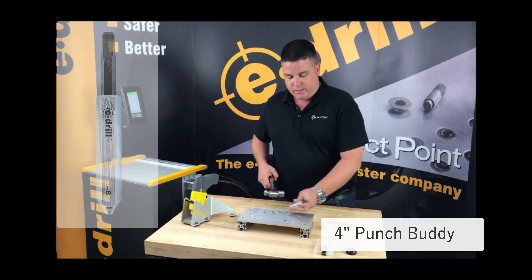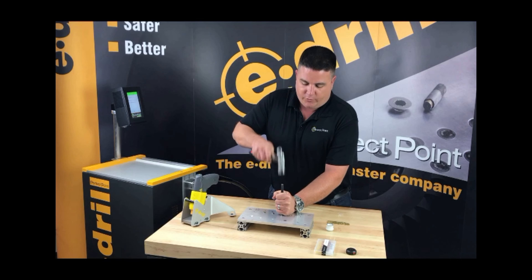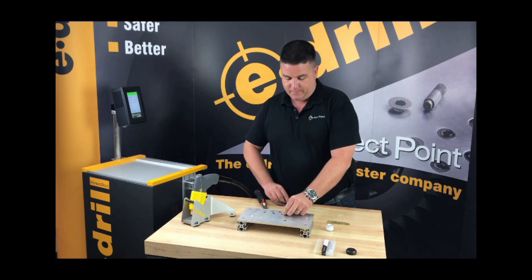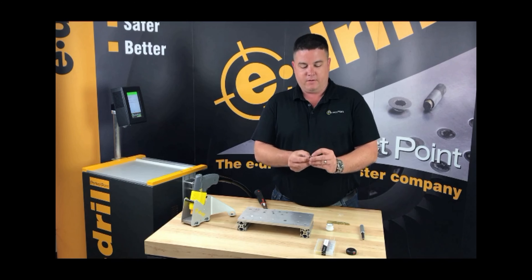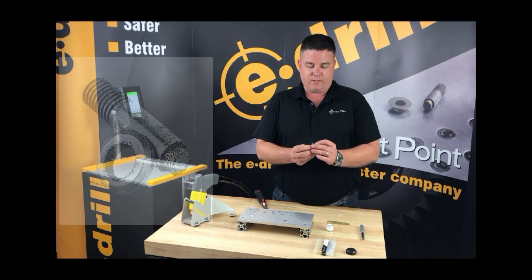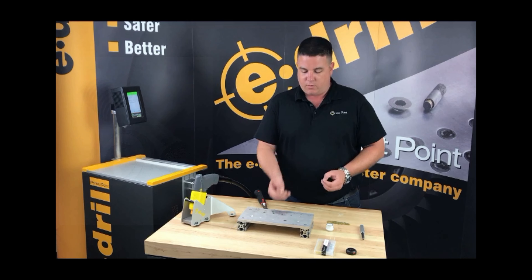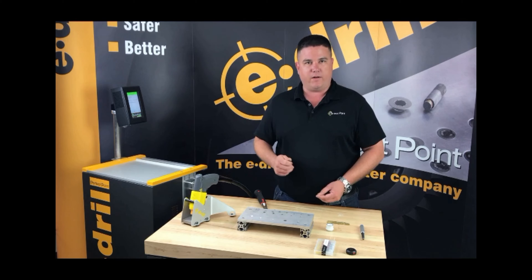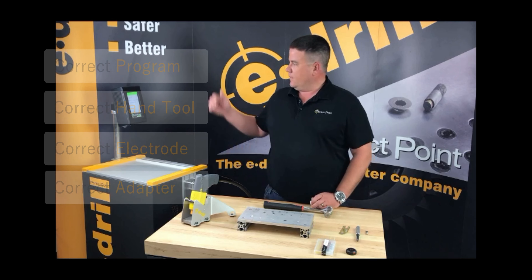All I'm going to do is take my punch, fit the tip into the groove I just created, and apply force. One hit — the fastener is severed. We check to make sure the fastener doesn't look like it went too deep or too shallow, and it didn't require a whole lot of force, so this is ready to go.